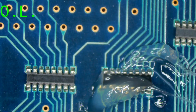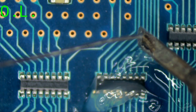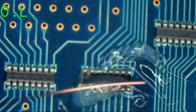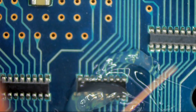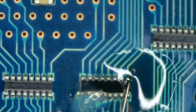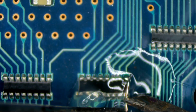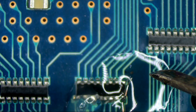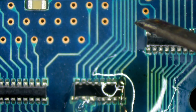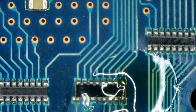So the first thing we do is put some flux on the board. I'm going to go for a jumper. I'm going to put a little bit of solder on the edge of this micro-pencil tip here. I'm going to tin the wire a little bit on this side. This is a bit on the big side — I may go grab some 48 or 50 gauge wire. This is, I believe, 36 gauge, which is just a little bit on the larger side for what I want to do here. This is just a little temporary hack until we get the proper resistor that we need. Once that is attached, I just pretend this is a paperclip, go back and forth, and break it off.